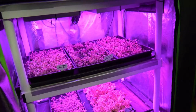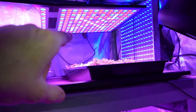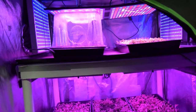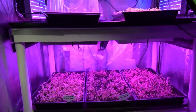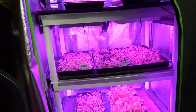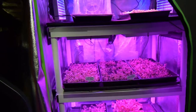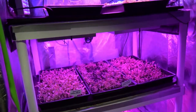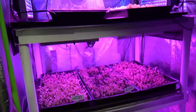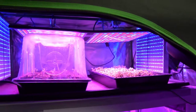You may have noticed in one of my videos I had the bad LEDs — the ones that were on top up here. The company is actually going to send me replacement LED lights along with the LED current driver, and I'll just reuse the frame. What I'm going to do is take those lights, get a new current driver, and build myself a light box out of wood. I'll use that inside the large grow tent as a supplemental light. The only thing wrong with it really is I believe it's just the current driver. If I get a higher-wattage current driver to drive those two panels, I can just clip off the old current driver and put my own in — you can buy them on Amazon for different wattages. Then we'll do some more experiments for you guys who want to do your own grow tents instead of throwing away lights you think are bad. You can always rebuild things.